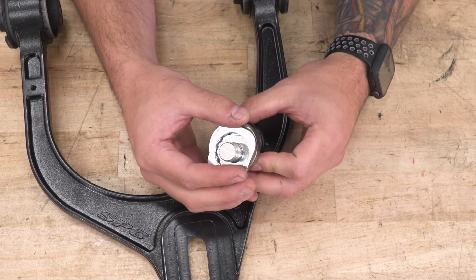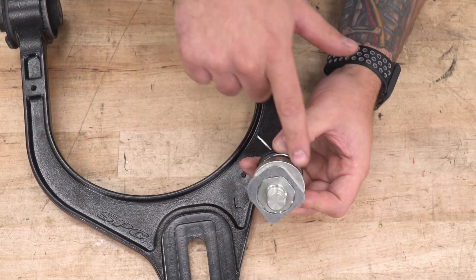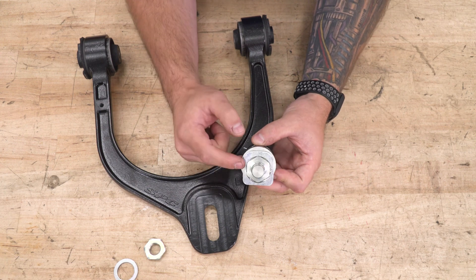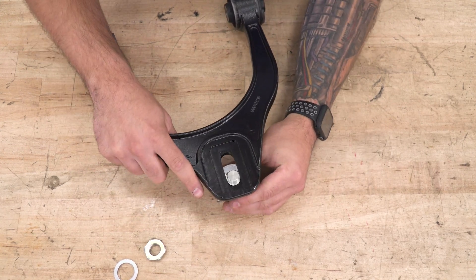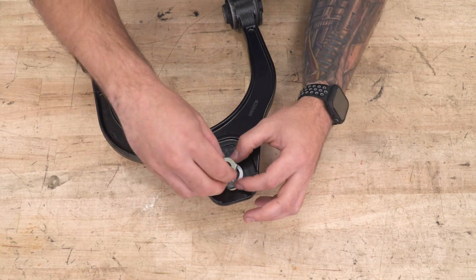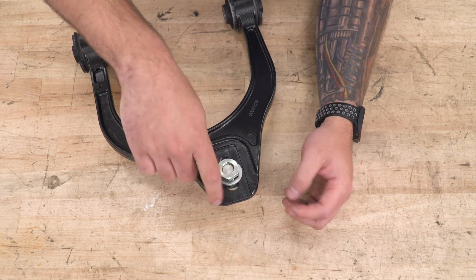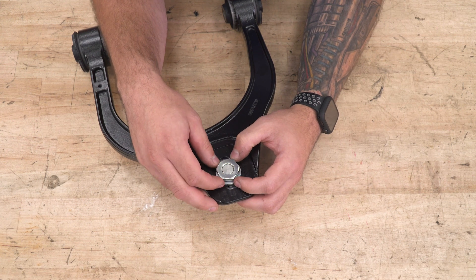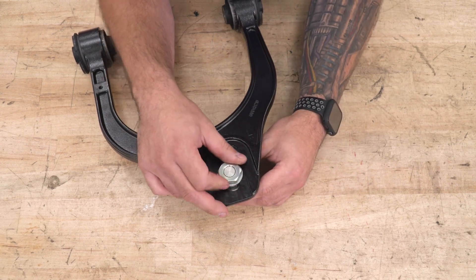Drop the plate on — it drops right onto the hex shape and you can adjust its position by rotating the ball joint, and you'll see the exposed part of the plate becomes offset in different locations. Start right in the middle — zero position, meaning zero degrees of adjustment. If you move it to the left, you're starting to get positive adjustment; move it the opposite way and you're moving negative. For the purposes of the video, I'm dropping it right in the middle to get zero degrees. Once dialed in, lift it up, slide it underneath — this is slotted so there's adjustment here as well.